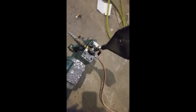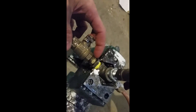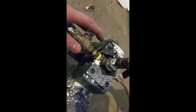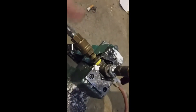In hopes of finding a different fuel source other than propane and typical liquid fuels, I've been looking into dry fuel. This is the setup I have: a quarter-inch ball valve, regular air fitting, quick disconnect, and then a quarter-inch NPT to some type of flare fitting. The ID size is probably around 230 thousandths, just enough to get a quarter-inch 28 tap in it.